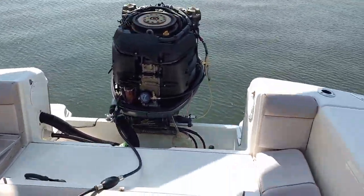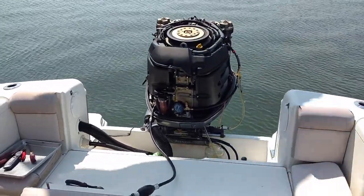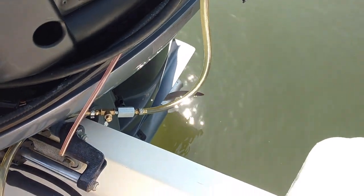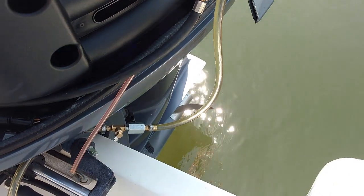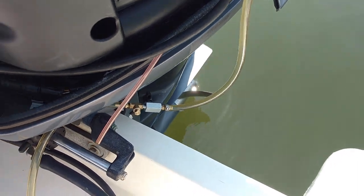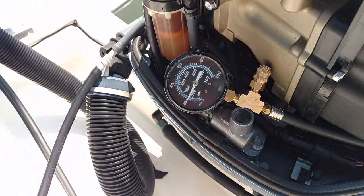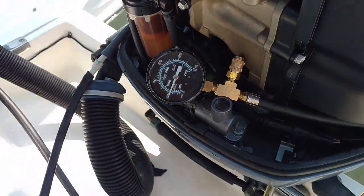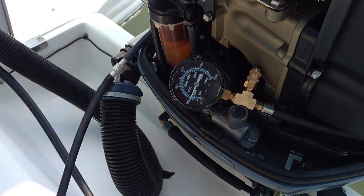Now we're lowering down in the water. I'm not going to make you wait the entire 35 minutes it's going to take to get the gear case in the water. Fifteen minutes later we're getting there, slowly and surely. The pressure gauge has been slowly losing pressure since I went key-off about five minutes ago to lower us in the water. At least one of the injectors is hanging open.